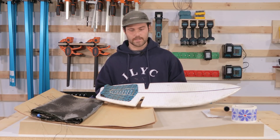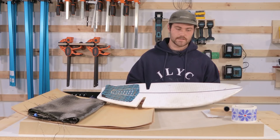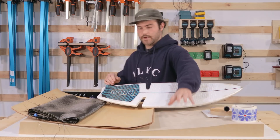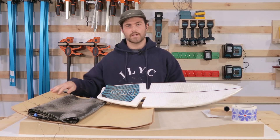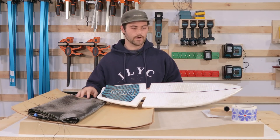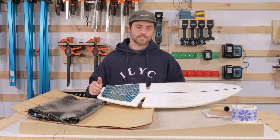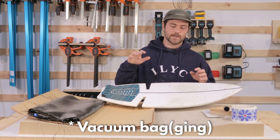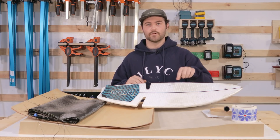The process we're going to be going through to make this is a fairly traditional skateboarding layup. We have a big mold here made out of MDF, we've got our skateboard ply, we've got our carbon, and we're going to be using a bunch of TotalBoat resins to vacuum form a skate deck down to the form that we've made.